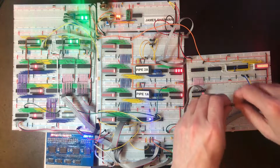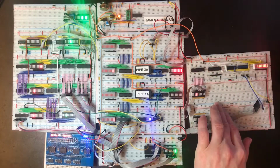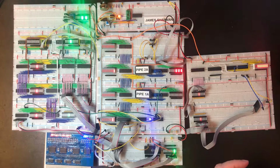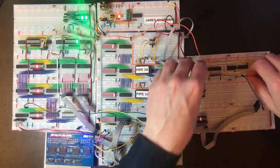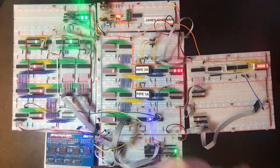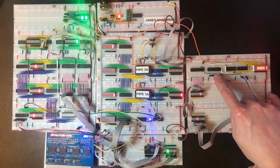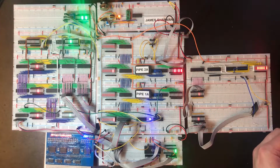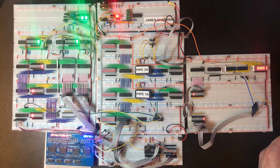I've got an idea actually. If I put one of these resistor arrays in here, it should pull all of the right hand side down. Then in theory I think we should gradually expose this input if we're getting these wires correct. So the input to the right hand side is now 0. So what we've got here should start appearing here. And we've connected the second bit, bit 1, in, and yes, that's low.